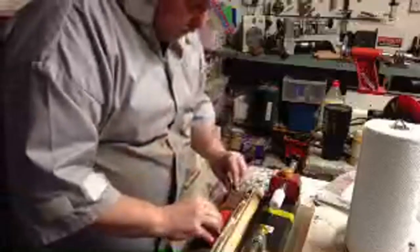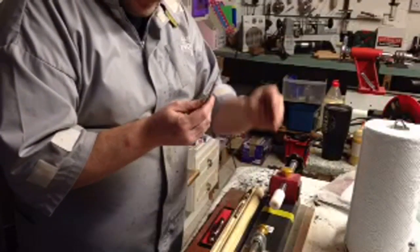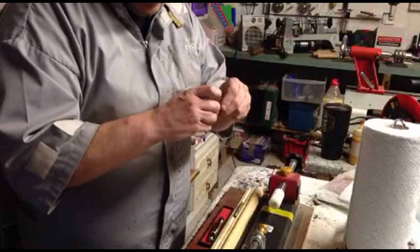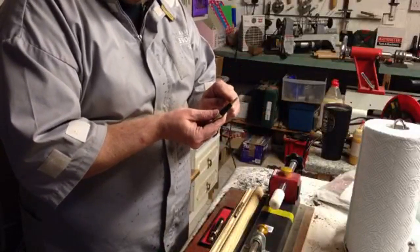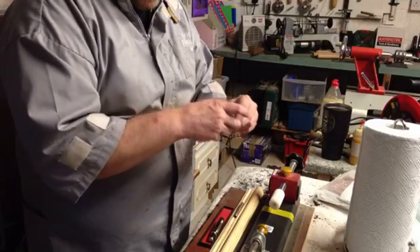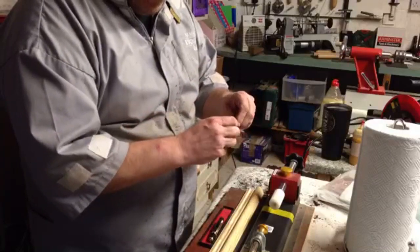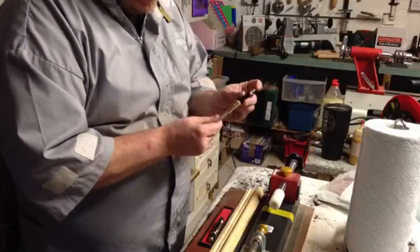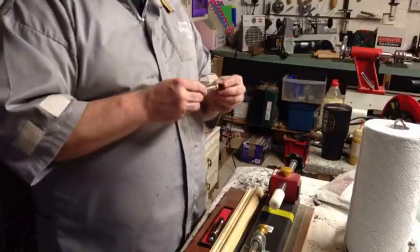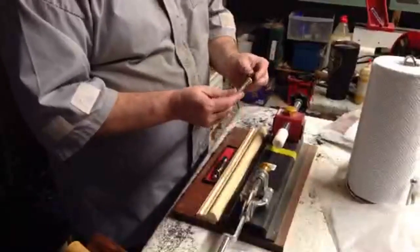So what we need to do then is get the refill ring that goes over the thin nib end, and let's just feel for that. So that goes over there, and then that just goes in, and I just push that through to make sure that the spring, sometimes you can trap the spring against the wall, the internal wall of the nib. So just make sure that everything's in there. Simple now, mechanism. You can feel for what has the open end, and it has the thread there that slides over the refill. And while applying pressure, you thread it home. And then we have a check. Oh, we've got to move the camera down a bit. And then we have a check that the mechanism... Is that better? ...is operating.